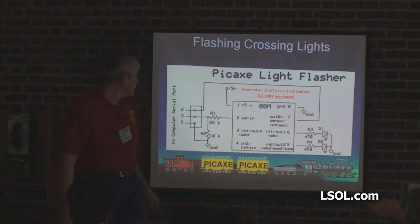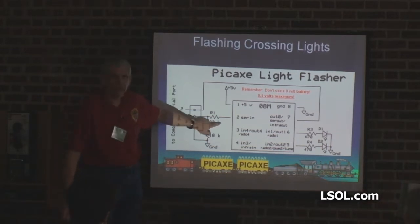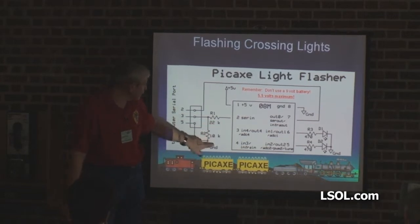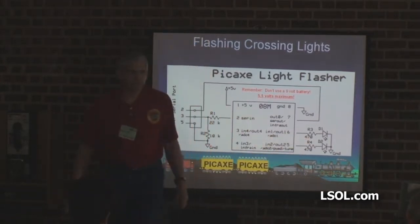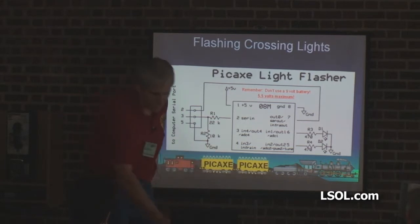K means 1,000 — a 22,000 ohm resistor, a 10,000 ohm resistor. 470 is just 470 ohm. You can use a 1K, it doesn't really make that much difference.